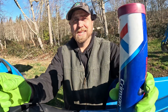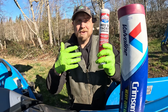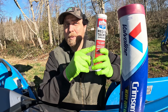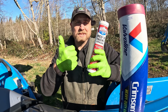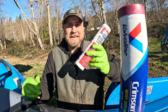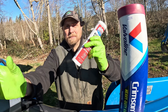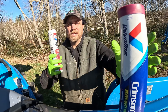That said, I think lithium grease is just the best choice for a tractor. The properties of lithium grease are that it's better at dealing with water and better at dealing with spinning — if something spins really fast, lithium tends to fly out less. You'll see it used on wheel bearings a lot. So water resistance and spinning resistance — if you're using this on your PTO shaft, that's where lithium comes in handy. You have a little less squish-out resistance than with moly, but you'll be greasing all the time anyway, and you just need one kind of grease.